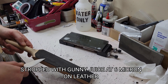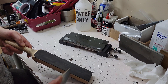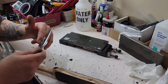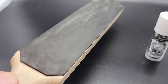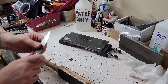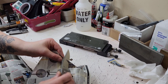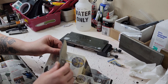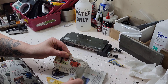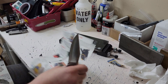The edge felt very, very sharp and very keen. I haven't sharpened a lot of ZDP-189, so I can't speak to the best grit to take it to. The owner of this knife wanted it at 600 grit, so that's what he got. I wound up stropping it on six-micron gunny juice and on a leather strop, and I'm very, very impressed with the steel. It seems it's done very well, felt very good. I think you want a little bit of experience sharpening before tackling a steel like this, but I honestly don't think it's going to be incredibly hard for people to sharpen.